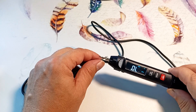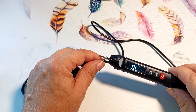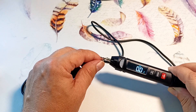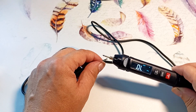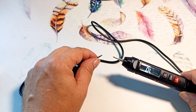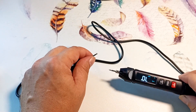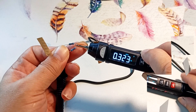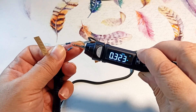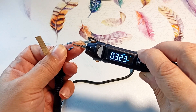In the same mode we can ring circuits. When the resistance is less than 50 ohms, a beep sounds and the device shows the resistance of a closed circuit. But in this mode the device correctly measures only small resistances — for example, trying to measure a resistance of 220 ohms, the device has not switched from diode test mode and is showing incorrect data.